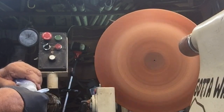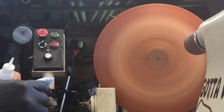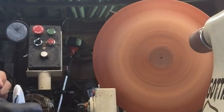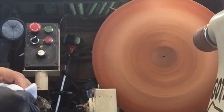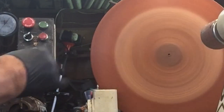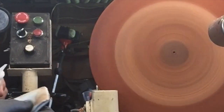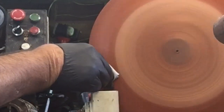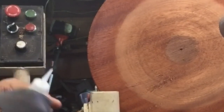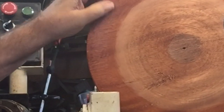CA doesn't dry, it cures. I walked back and forth on it a little bit because it was already a surface. That is one coat — it's soaked in a good bit. I flip the pad around. I go back in and put another coat on. Now I've got three coats of CA and I'm already developing a sheen. It's slick as can be, but it's not ready yet.